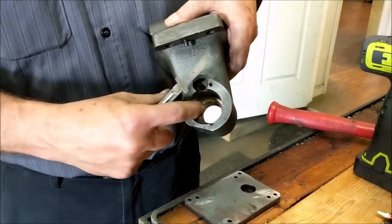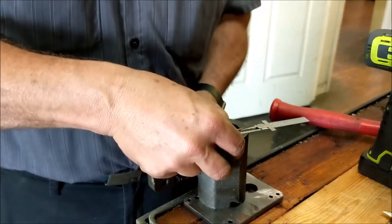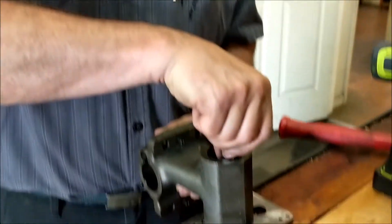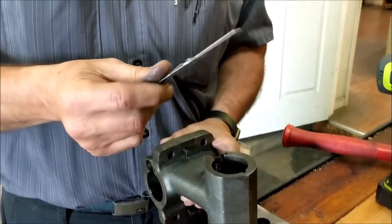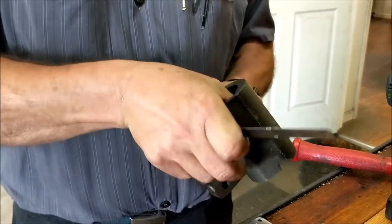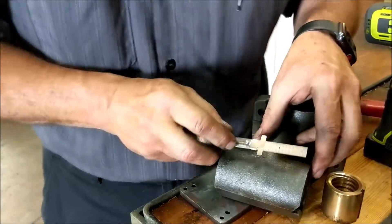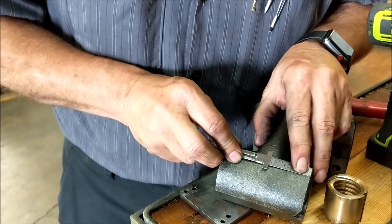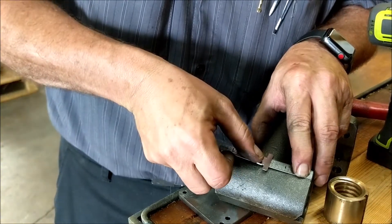When you're going to put your half nut in there, put it down on a surface where you can get it flat and take your scale — you can use a depth mic if you're really fancy. Go down and mark the point where it touches the bottom, then come up to the edge and make a mark. But what we're going to do is go an extra eighth of an inch beyond that.